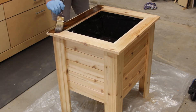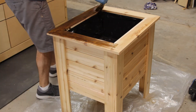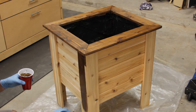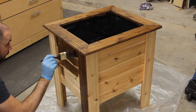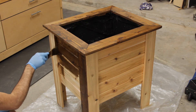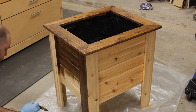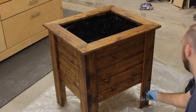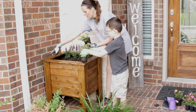This next step is completely optional, but since the natural color of the cedar didn't match the color of the stone on our house, I decided to stain it a bit darker. I put two coats of stain on the planters followed by three coats of spar urethane to protect the planters from the elements. My front porch gets assaulted by the sun on a daily basis, so I'll need to keep a close eye on them to see if I need to refinish them. And with that, the planters are finished.